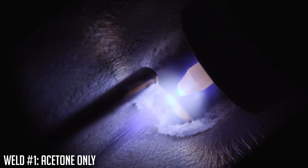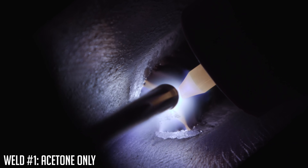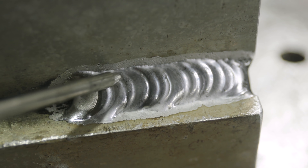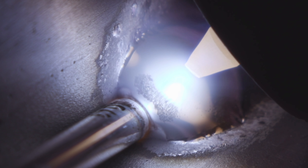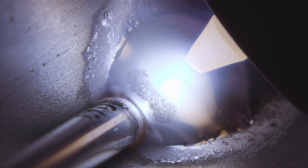As you can probably tell when I was welding, I've got some nice little floaters in there. Depending on the angle you're viewing from, you should be able to see some of that peppering on the piece. That's because it's pulling up all the little contaminants and oxides into that weld — they rise to the surface and hang out right there on the weld once it's solidified. That is the contamination.